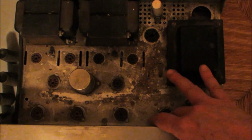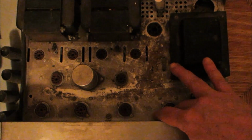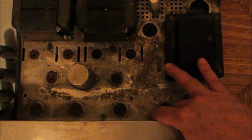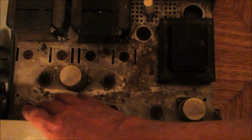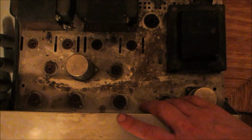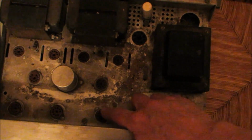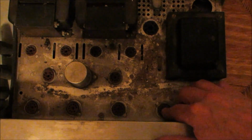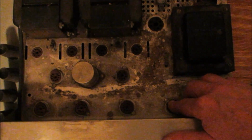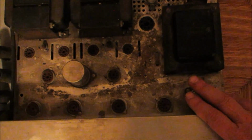But with the amplifier that I intend to put in it, it will be a vastly different machine, and it will have the equivalent of my Type 121 preamplifier in it, with the exception, of course, that I never bothered to include a tone stage. But this Baxandall stage, it's history. That's simply going to be a line stage driving the power amplifier, and it will in no way correspond to these circuits. But these ones here are very similar to my phono stage. There are only a couple of adjustments, so I could leave it intact, except there's no chance I would do that. You know, all of this junk is going, and all of the parts underneath, they're all going to be stripped out and replaced with new parts.